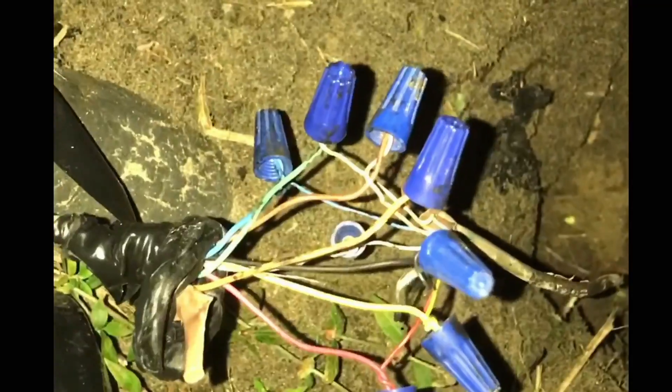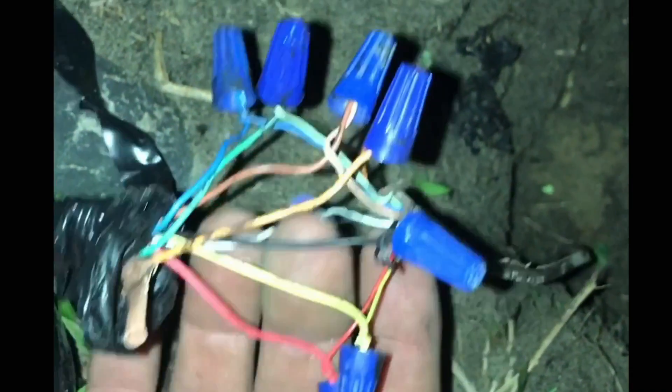First step of any short diagnostic is a visual inspection — all your wires, all your trouble points. See if you can find that short. The very first place I look is inside the condenser. Really common to have rub-outs in here on low voltage lines, on your copper. Check your common spots first — trouble areas like a splice here, you'll definitely want to open that up and take a look. I've gone over this whole system and everything looks fine, no visual shorts. But that's where you want to start — see if you can find it with your eyes first.